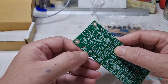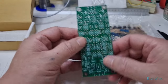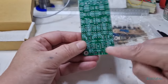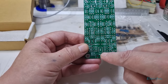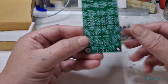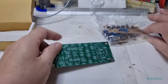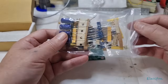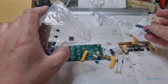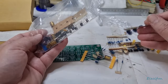We've got an LM7812, so there'll be an LM7912 there for a plus/minus 12 volts going through here. One of the nice things about this op-amp — that's a 5532, JRC, Japan Radio Company — and the nice thing about this particular kit is it has actually given some suggestions on different op-amps that you can use. With the JRC 5532, there are quite a few op-amps you can swap those out with.